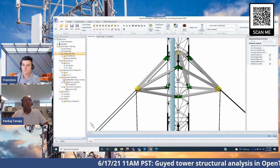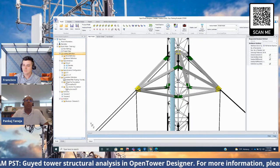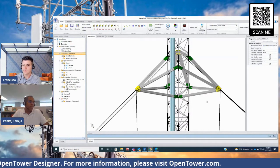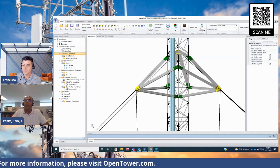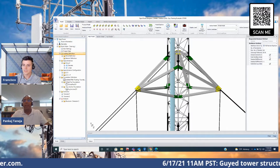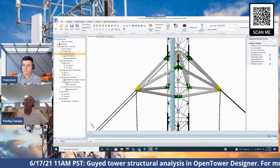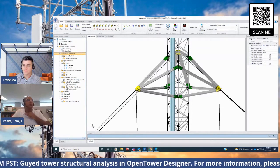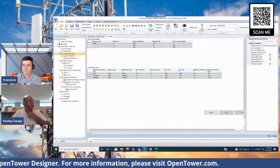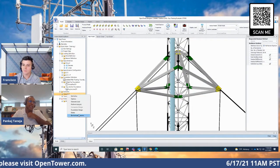Sometimes they are already braced in the middle, so the bracing is not only like, just brace it and reduce the k factor. But in reality, reducing the k factor is limited to the design part. Our intention is, why not take the stiffness of that member into the structure too? So we created the tool where users can add all these other members. So we're capturing the added stiffness from any truss elements added to the torque arm, yes.